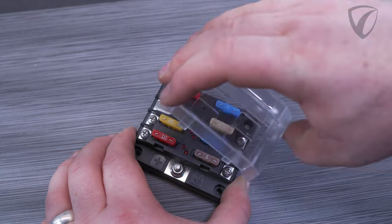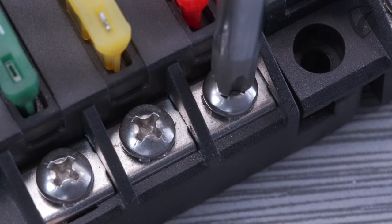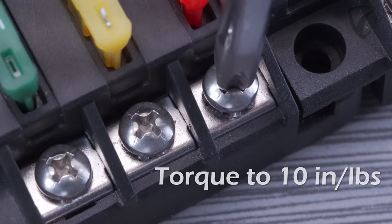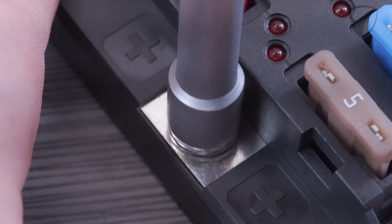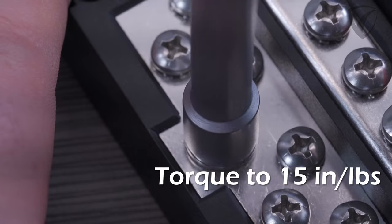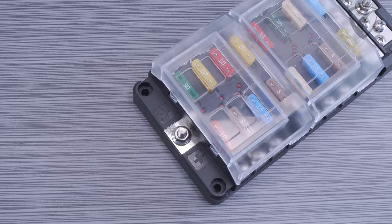The blocks have all stainless hardware with Phillips-driven M4 output terminal screws that can land up to a maximum 10 gauge wire, which should be tightened to 10 inch-pounds. The M5 input studs have a nut that you can drive with an 8mm driver or socket, tightened to 15 inch-pounds. Also of note, on the input terminal you can use a maximum of up to 2 gauge wire.